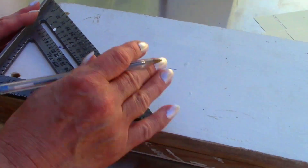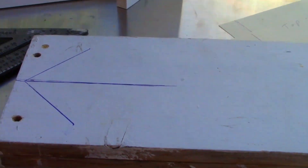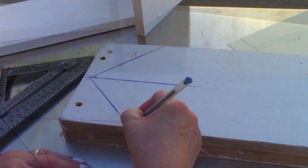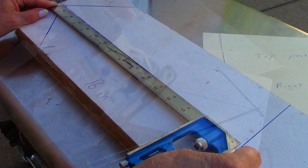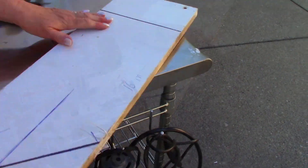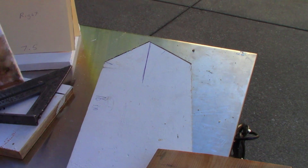I'm using one-by-eights, but they're not true boards — it's generally one-by-seven and seven-eighths. Make sure you know ahead of time which side of the line you're going to make your cut on, because it will make a difference in the measurement of your angle. From the peak to the base it's going to measure 16 inches. When I assemble it I use two to three inch screws and that will make it very sturdy because it will be outside. These birdhouses are often used for inside decorations or under the eaves of a porch, but if you're going to put it outside I would recommend using long screws as well as reinforcing it with wood glue — it will be much sturdier and last a long time.